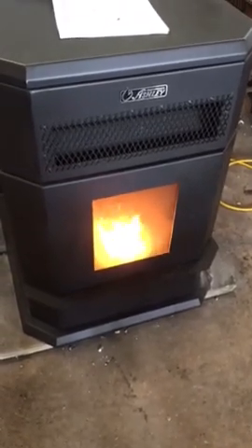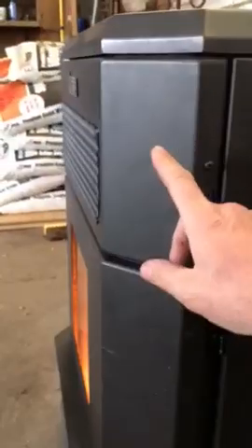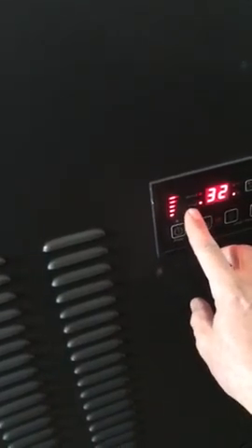It's been running for hours and I haven't had any other issues. Also, I forgot to mention — before I cleaned that sensor off, I couldn't get the panel to go from manual to thermostat because it wasn't running long enough. There's a program where this thing has to run a certain amount of time, and your fan will kick on high if you have it at high temp. After maybe 10 or 15 minutes, you're able to switch from manual to thermostat.